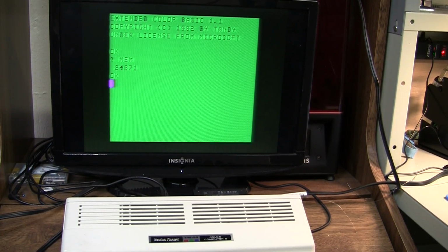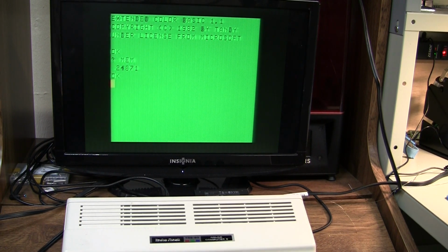So the RF output is just abysmal. And there's really not much that can be done to improve this. There's really no other noise in this RF range, so there's not interference that we need to knock out. I think it's just the age of the components and maybe even the design of the MC1372 itself. So you just can't get good quality out of the RF modulator. And really, with composite mods, you can't expect a whole lot more than this. But this is the baseline. This is what we have to work with. Let's build up this mod and let's compare this Mark Data Products circuit to what we're seeing here.